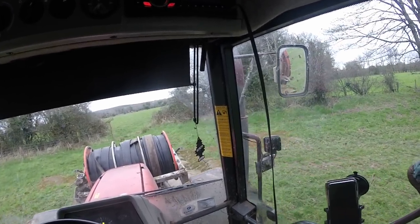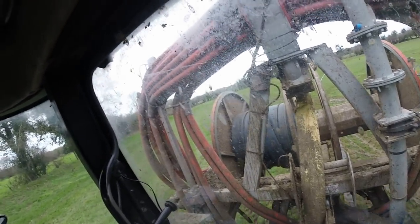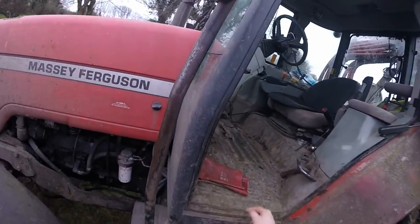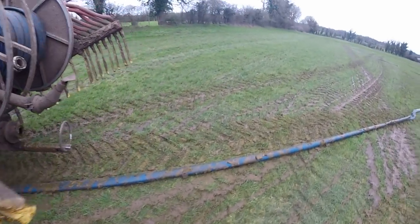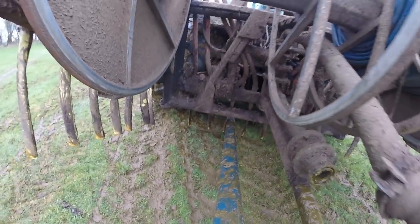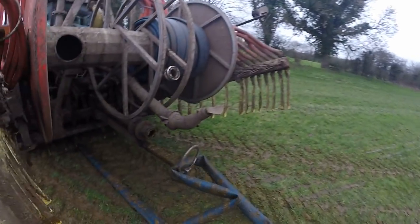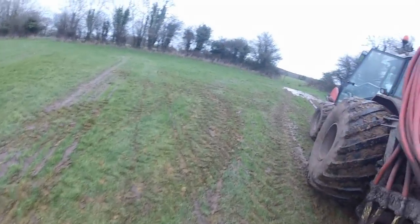We drive out the piping, then get ourselves off the pipe. You want to try and gauge it so you'll have enough to pull the piping under the fence — maybe around there. We pull back some of that, throw a loop onto the wagtail, and that should pull it. I might just throw a second loop on it — depends on how much pipe there is. With the weight of the slurry in it sometimes it won't pull, so a second loop just helps get it caught.